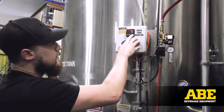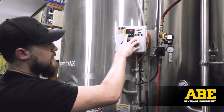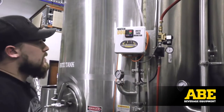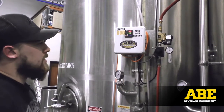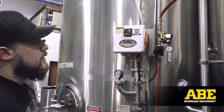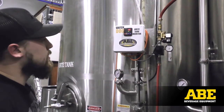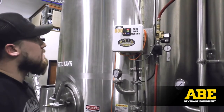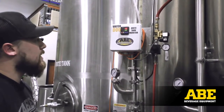Just for a quick demo here — say we want to maintain 5 psi feeding our machine, we can set it and watch how quickly it recovers, because we are feeding with 30 psi. This tank is going to take just a little bit of time because of the excess headspace we have in here currently.